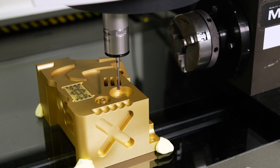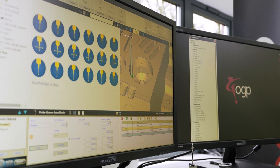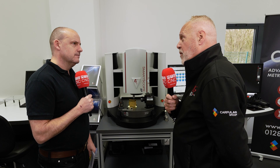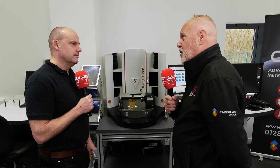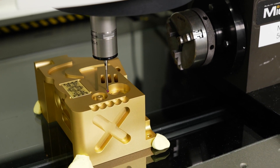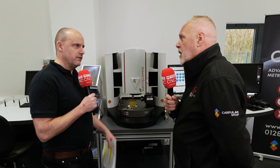Now we've got the stylus in here, so this is a different way of measuring the part, or certainly this bore. Why would you choose that over the optics? Well, if you're looking at optical, we might look at the top of the part or the bottom of the bore. By using tactile, we can actually go halfway down the bore. A camera can see top-down, so we're actually using a stylus on this particular application to scan around the side wall of the bore. Would you have a docking station where you keep the styluses? Dependent on what the customer wants and the bed size they choose, you could have a docking station. We could integrate into robots, so it can be a full production routine on the shop floor if required. There are many different solutions for a customer with a system.